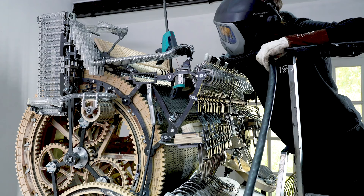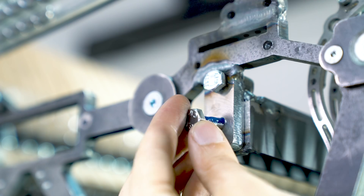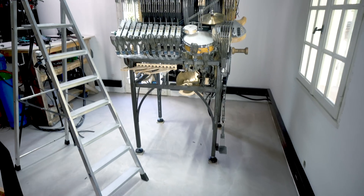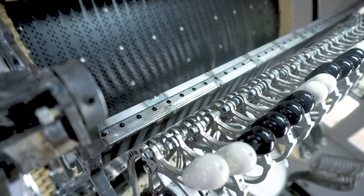I've designed this to be positioned in the corner of the frame so I know exactly where to weld it on. My CAD dimensions seem to work out perfectly — the bar fitted perfectly into the frame of the Marble Machine X. So now I can move on to the spring tension mechanism itself.